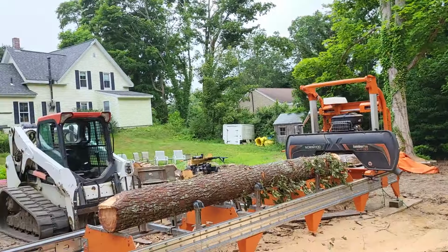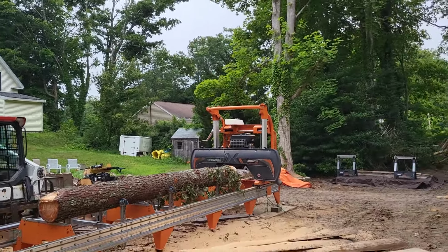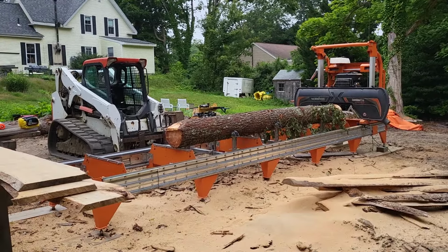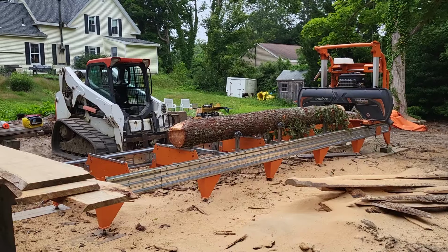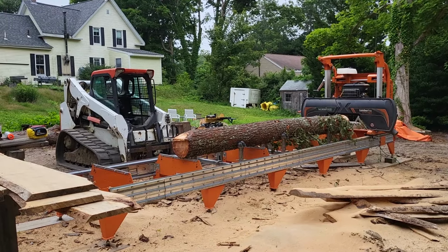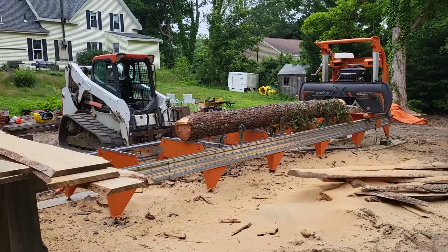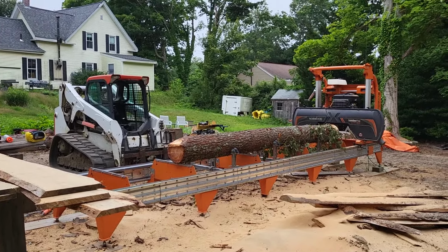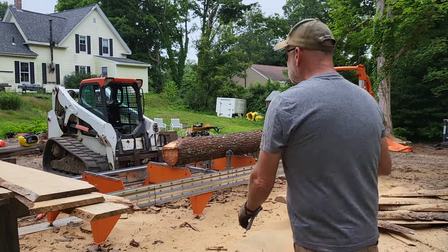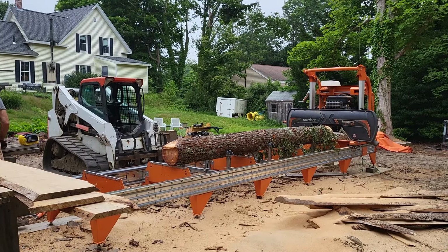So I've got into this 12 minutes already. We're going to fire up the mill, take the top off it, flip it over, get it into a cant and then mill off some boards. I've already got my 4/4 scale set. Danny's chilling out over there. You'll be able to see speed of cut on a 12-foot log. I'm just going to guess that before I make a cut, I'm going to be at 13. So we'll go with 13 to get our time.